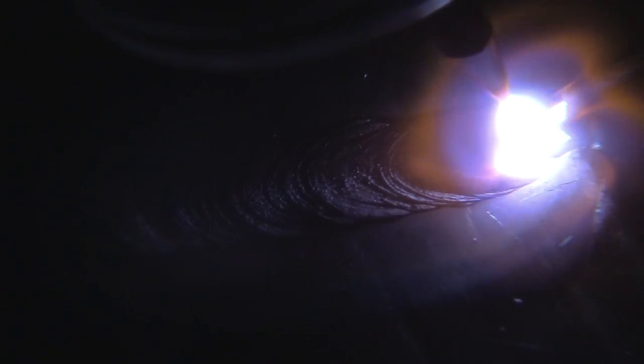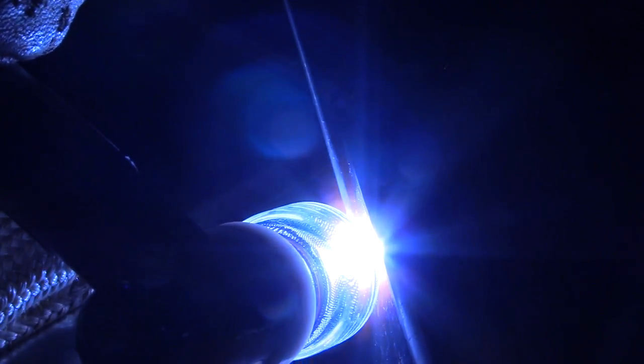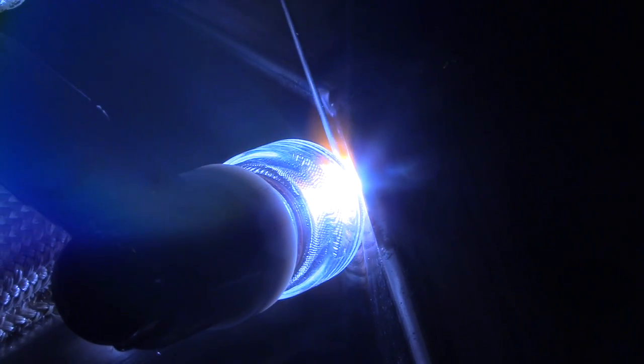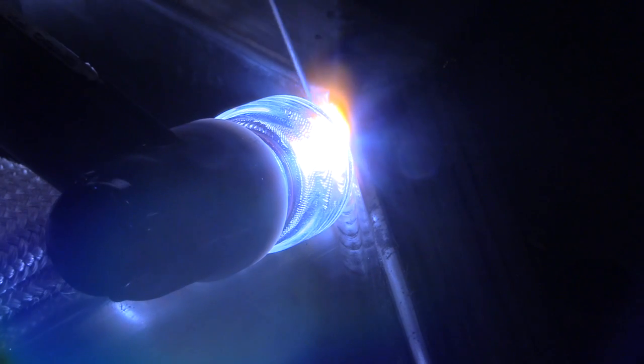I'm not coming very far out of that puddle — I'm keeping the hot tip of the rod shielded with argon. For fillet welds you don't really need to penetrate all the way through the back side; you do need to penetrate into the root of the joint. But if you do penetrate all the way through, what happens is you'll draw oxides in from the back side — they'll enter the puddle, make it swim around, and make it a little bit sluggish.